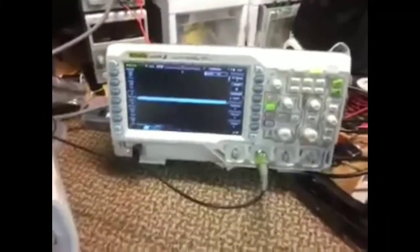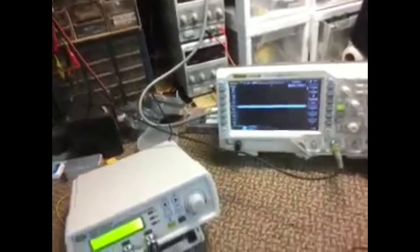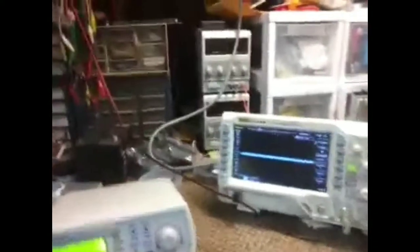So again, this is just a simple little 100 megahertz scope, and what I've got is a resistor. Just a little wire wound carbon filament whatever resistor, nothing fancy, as my antenna hung maybe 2 feet away from it. And what that's going to do is, let me touch it here and you'll be able to see it. It'll actually hear the ringing frequency of the Tesla coil.